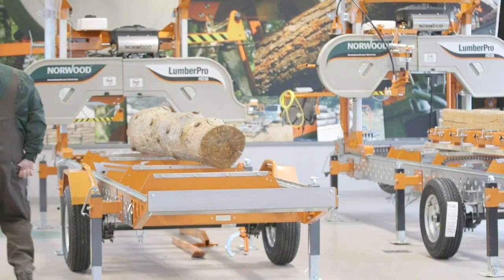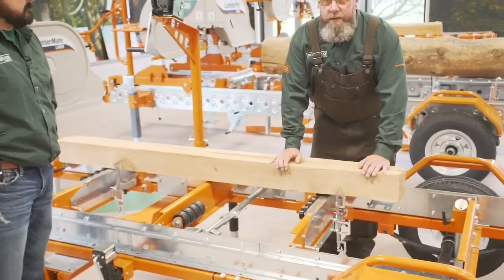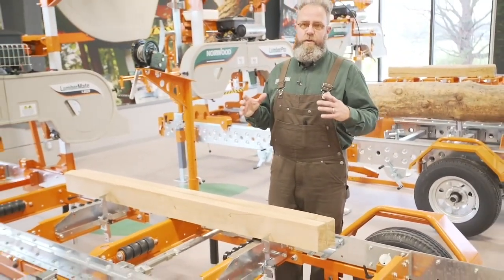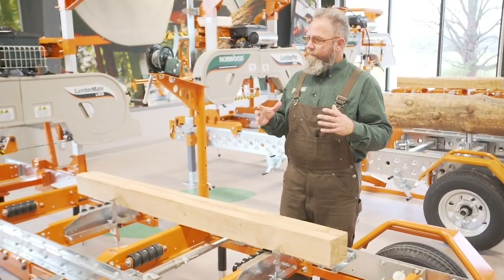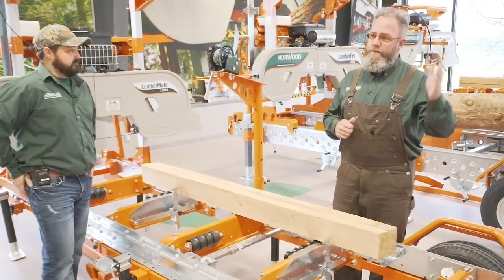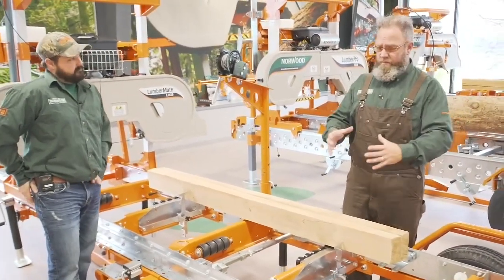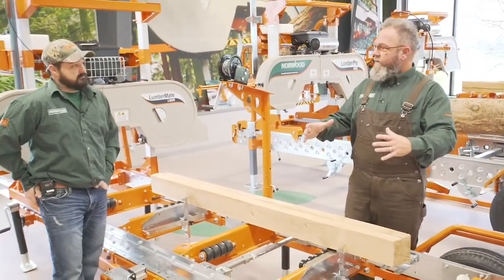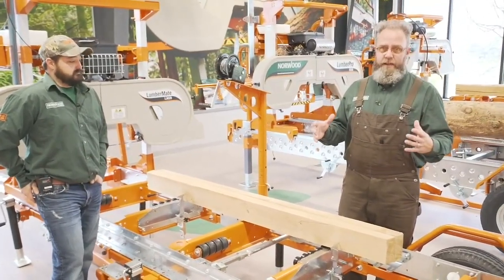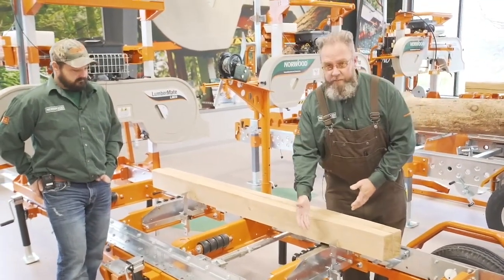This is the rapid rolling and dogging system. It's not something utilized by everybody, but it works very well for people who are specific in the industry to smaller trees. It was developed more for guys that have what they call lodgepole pine or plantation pine — where someone went in 15 to 20 years ago, planted seedlings, and now there are rows and rows of trees all about 12 to 14 inches in size. Because those are all consistent and fairly light, you can save a lot of time using this system.